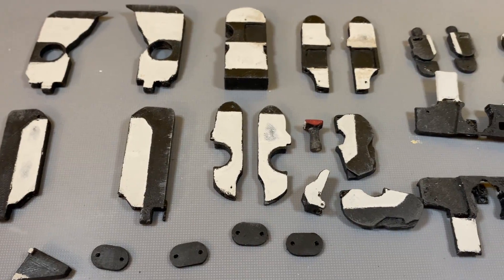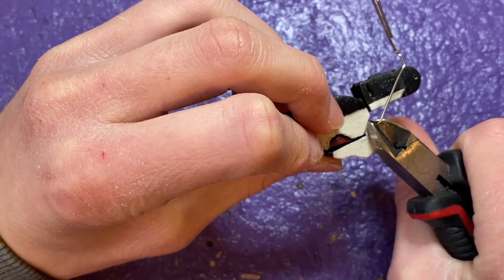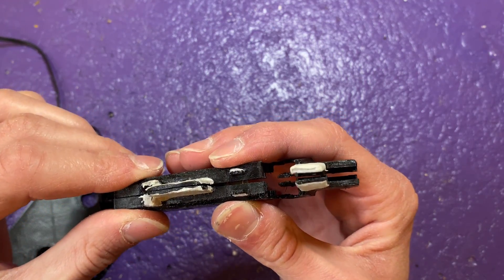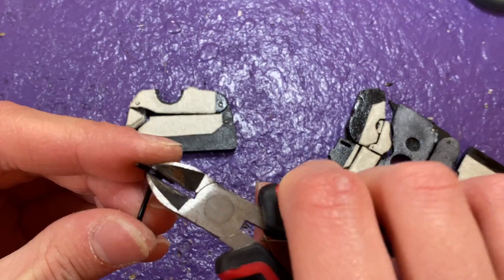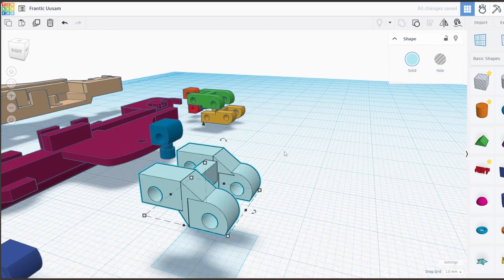Finally I did a quick weathering pass — I want him to look like a tape that's been left in a drawer for a while, but not so much like a Decepticon warrior who's been in a few too many battles. Now that everything's painted, it's time for the final assembly. Or so I thought. From this point on, Ravage decided to be a problem project. The hips of the cat mode were really tiny pieces to fit inside the cassette parameters, and they wanted to snap and break over and over. I also forgot about the laws of physics — two pins can't exist in the same place at the same time. Combine that with a really thin piece crucially connecting his entire neck assembly to the rest of him. My poor planning and design ended up coming back to bite me. I spent a few days supergluing the same part over and over, trying to sand it and get all the tolerances to fit — but in the end it was not worth the time, and it was better off just redesigning it.